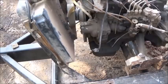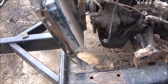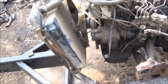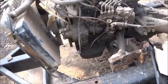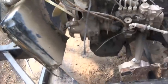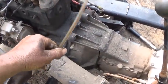We're going to get the radiator mounted now. When I went to load this truck — when I bought or traded for it — I saw antifreeze leaking out of the radiator or toward the front of the engine onto the bed. So we're going to get it tied up; I've got some heater hoses that need to be plugged off, but I want to get some water in it just to see if there are any leaks in that radiator, if we need to solder or fix anything. We'll get the radiator mounted. The fan didn't hit it too bad or knock anything in it. There's a manual fuel pump there but I guess it's also got a regular pump — that's all it had for a fuel line, so we just need to get a tank on it.